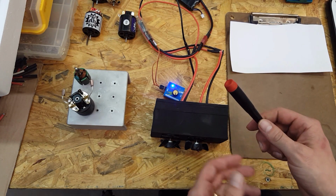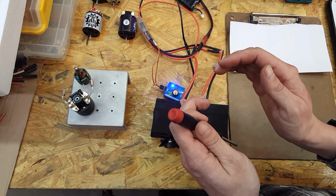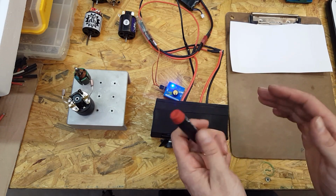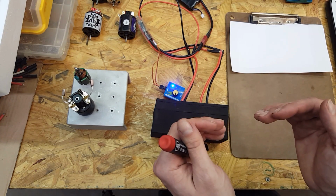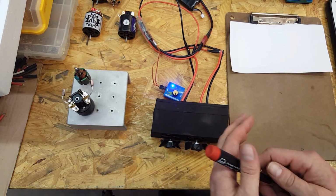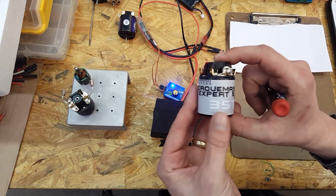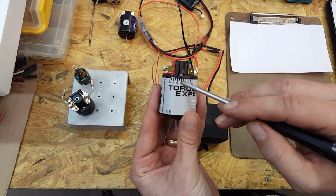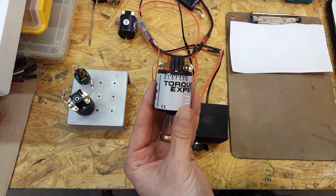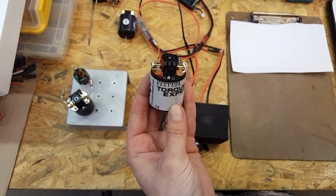So that's one area where there may be a little bit of variation. The magnets themselves can actually have a little bit of variation to them, or maybe they're not placed in the can quite square. One way or the other, there can be some variation to the magnets that will cause your electrical 0 timing to be slightly shifted from your mechanical 0 as you would normally expect it. Now, there's another issue: let's say when we put our sticker on, we didn't line it up exactly. Maybe it's just off by a hair. That would also cause your timing to, at least visually, be out of whack.